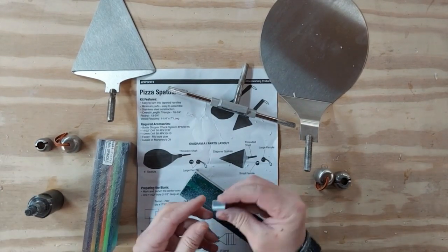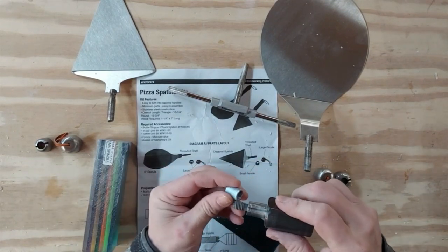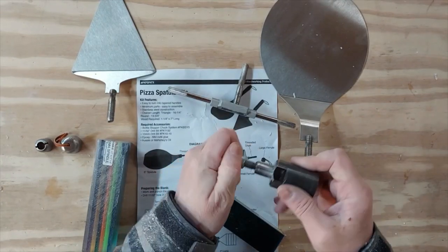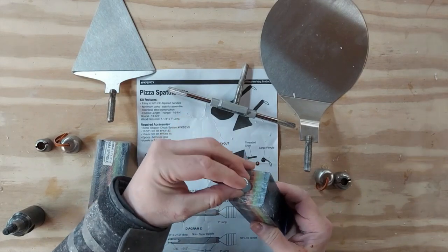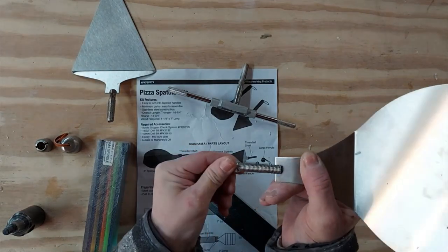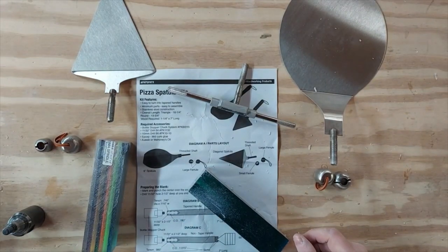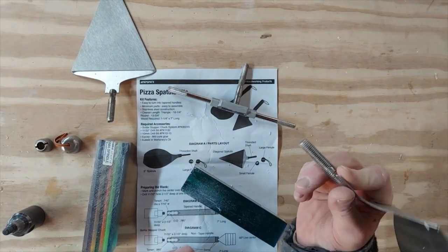I have inserts that you could also use for bottle stoppers. The inserts naturally fit the bottle stopper threads. And what you do is drill a 1/2 inch hole and you epoxy that in. But yeah, it wants to go, but it's the wrong thread. So now my options are getting a little more limited. Now I can try to figure out the thread.